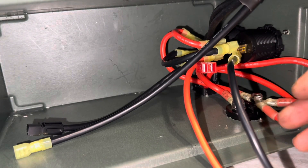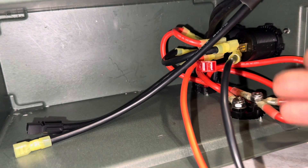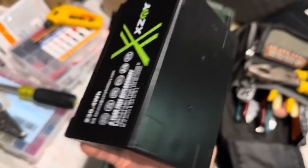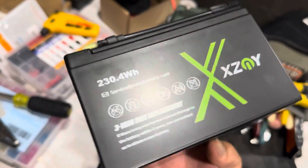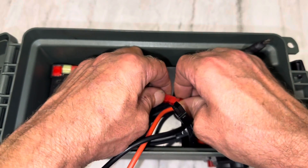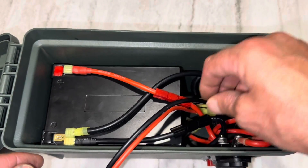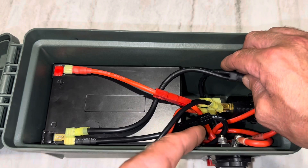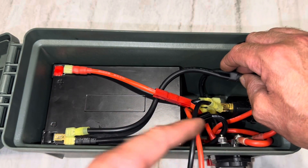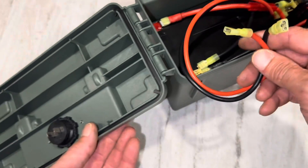This is version 1.0 — just showing you some ideas. It'll vary depending on where you put your accessories. I'll put the XZNY 18 amp hour battery in, which gives us 230 watt hours of energy — a little four-pound battery. The Anderson power pole connectors connect positive to the breaker. I've got a little high-temp piggyback on the battery positive side. I use the breaker as a semi-junction block to feed all the loads off the load side, with heavy duty high-temp piggyback terminals on the battery.